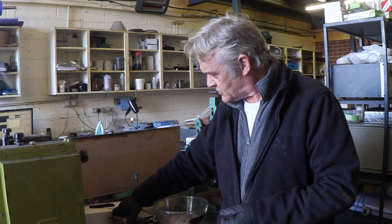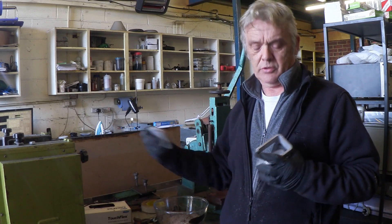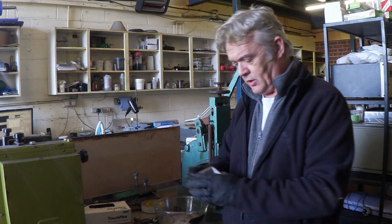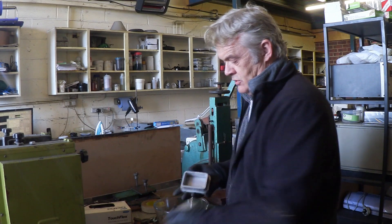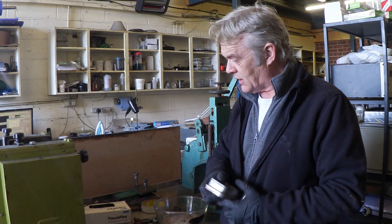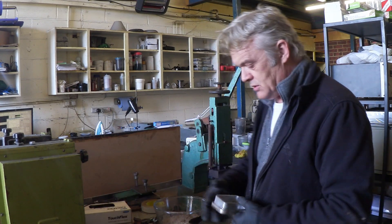To make that I used this aluminium soap mould that I had kicking around. I can put my bioplastic into the mould cavity, stick the lid on, get some heat in there, press it down, and I'll end up with a nice plastic block like this. So this is a heat-pressed mould.